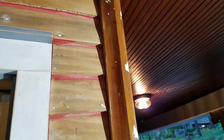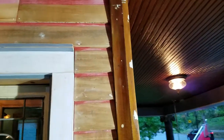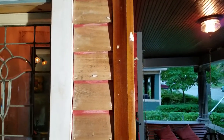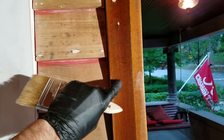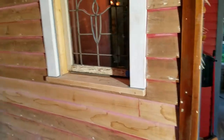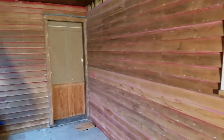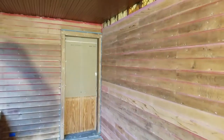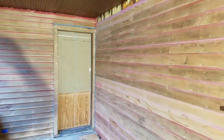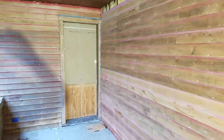There it is — the pre-treatment. It's going to soak in and allow the primer to bite really deep and really well. We're going to let this sit for 10 minutes, come back, wipe off the excess, and once it's tacky, prime as usual and paint as usual. We'll show you the progress as we go — pre-treatment, then primer, then two coats of latex paint. Alright, I'm gonna get back to work. This is Chris from My Old House Fix — see you guys!